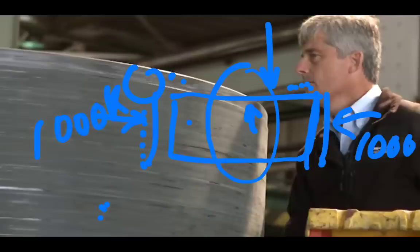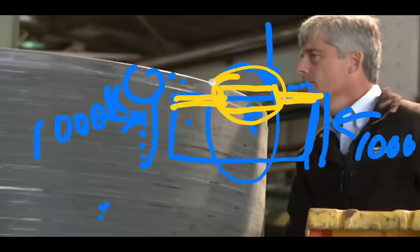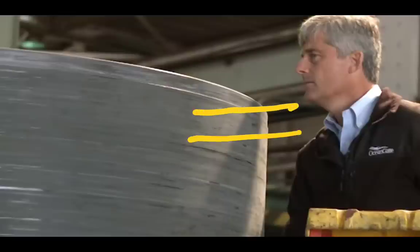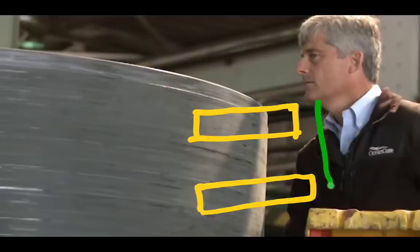The section isn't uniformly fat — it tapers off. To resolve the buckling issue, think of it as adding more steel to the column length. Is the width of this ring equal all the way down? For buckling, you'd want the whole thing the same width. With pressure coming from both ends — like two hydraulic plates crushing this tube — it won't buckle there.